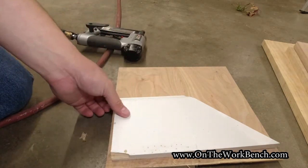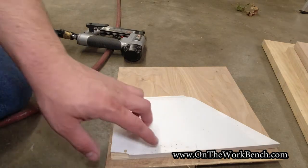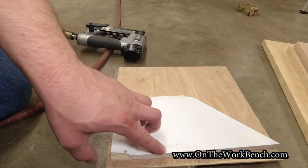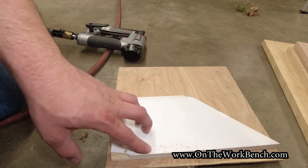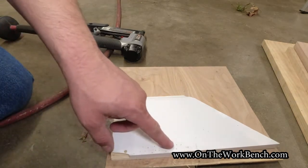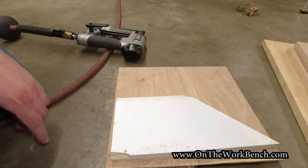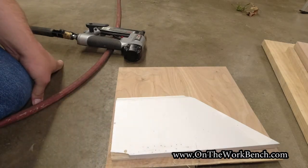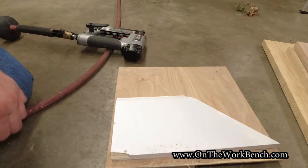And so that leaves me wondering a little bit more about the Arrow. And unless you're using the really short nails, it's hard for me to recommend. I just don't like how on the Arrow the drive shaft just is leaving marks on the wood. I would prefer it to be non-marring, and I don't consider it to be non-marring based on the dents left in the wood, especially this pre-finished board here. Obviously, I can tack it back over, but what I want is a nice flush pin nail at just a dip of a pin, if that, will hide it, or it can be set flush below the surface very cleanly, and I don't see that working with this Arrow nailer. So that's just where we're at on it.